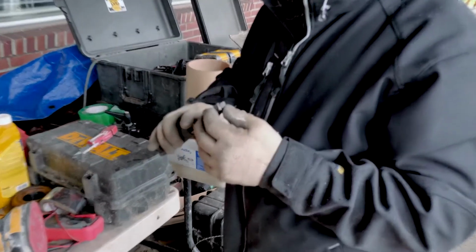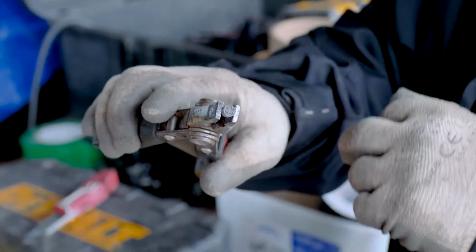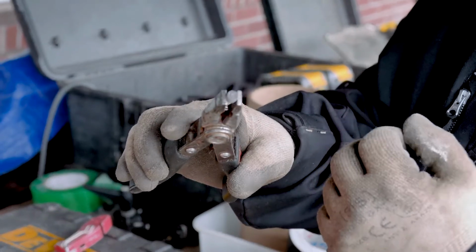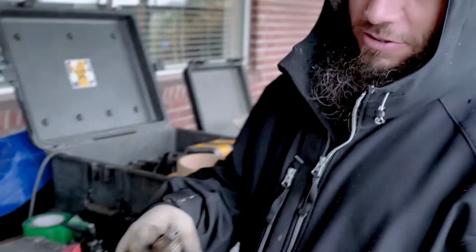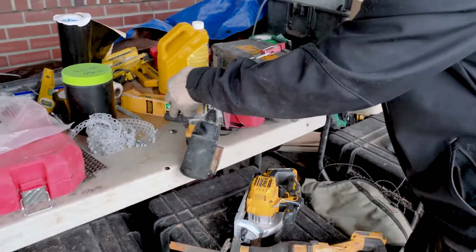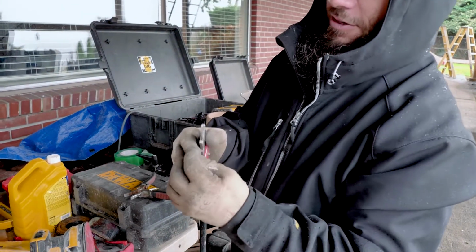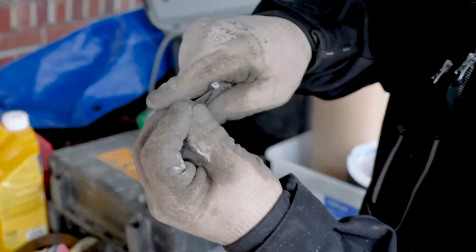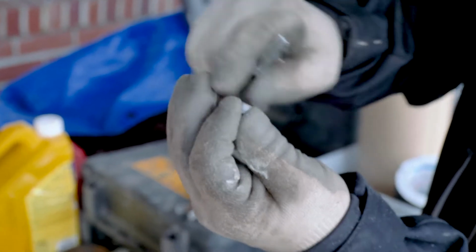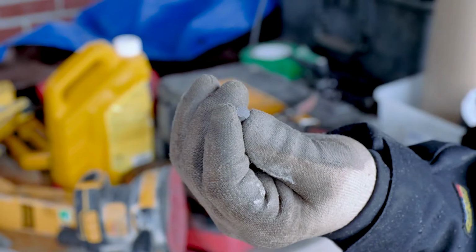I'm taking our Cortex plugs that are grain matched to match our deck boards, and I'm smoothing them out because the trim that we're doing, we're going into the side of the deck board, which has got a smooth finish on it. So I'm just taking this grain stuff here, hitting it with the sander. And if there's any left over, I'll take my razor blade, give it a little scrape to flatten it out. And now the grain is gone. It's smooth. So it'll hide the smooth side of our Cortex plugs.